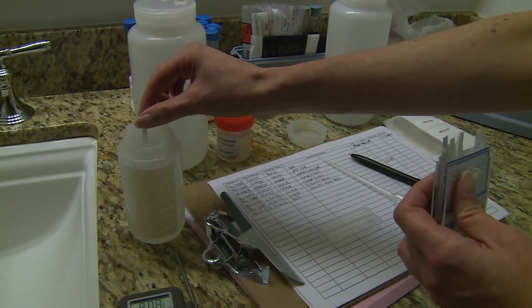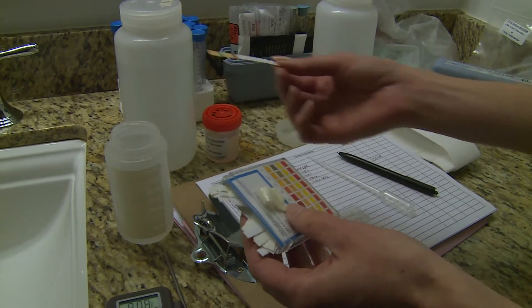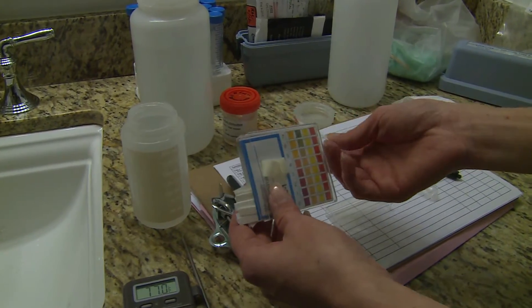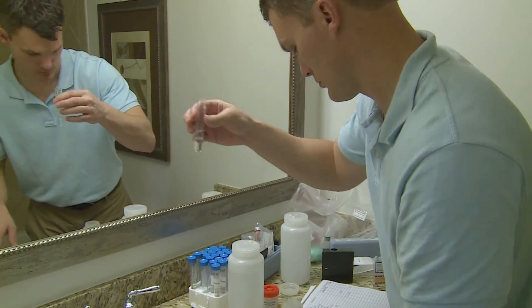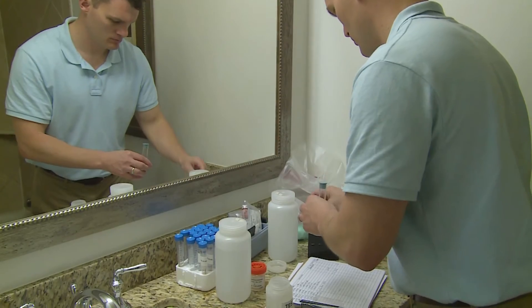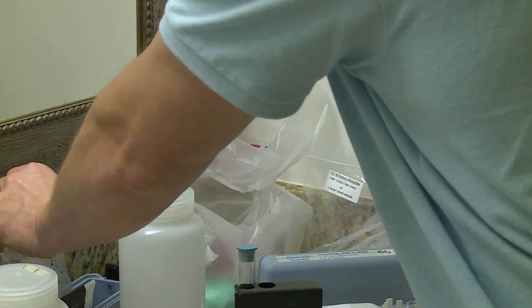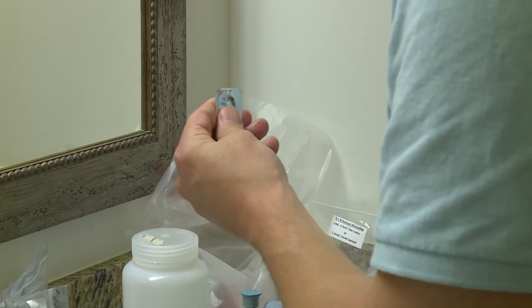Measure pH by placing the paper strip inside the bottle and comparing the colors on the paper strip with the legend on the box. Alternatively, you may use a digital pH meter. If you are using a colorimetric wheel test kit to measure chlorine residual, add water from the same water source to the control tube. Open the pouch with the powder and add it to the second tube. There is a different type of powder for measuring free chlorine versus total chlorine, so you'll need to know which one to measure.